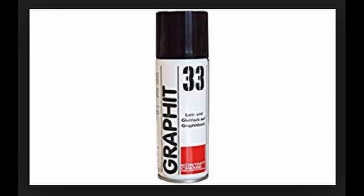Now I show the result of plating plastic with graphite spray. I cleaned the plastic with isopropyl alcohol, then sprayed graphite three times, rolled the wire onto the object, and plated it in the solution made earlier.